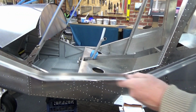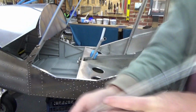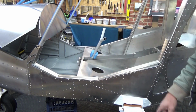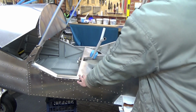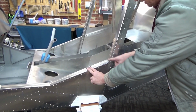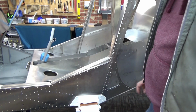Alright, so I've bent up this door sill. Some curves in there. Looks like Mr. Z or Zenith has done a good job actually. It's all sort of beveled out ready for you. So I bent that up. Now hopefully that should, bang, fit in there beautifully. 1, 2, 3, 4 curves. It's a little bit of play once I drill in the Clecos. And this back corner here, it says clearly in the instructions, just bend that 3 times because it bends up, it also bends in because the fuselage changes direction here. So, beautiful. Robert's your dad's brother, or Bob's your uncle.